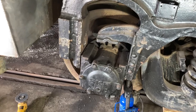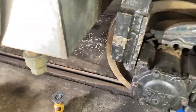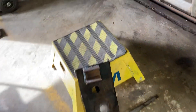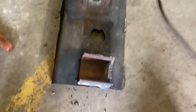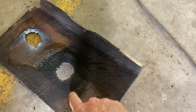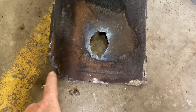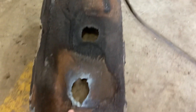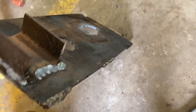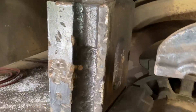Three days later, the boys — I couldn't be up here, so Jim Arnott and Matt Schilling actually got the plate out. Hey Matt, where's the original plate? There it is. So they had to do some fancy stuff here with it. The plate was stuck right here as well as jammed in here. On the other end it was stuck in here, so we had to blow that out. What the guys did is they welded a C-channel on and then jacked it out from the box, put a jack in here, and actually jacked the plate up and pulled it out, and it worked out pretty good.